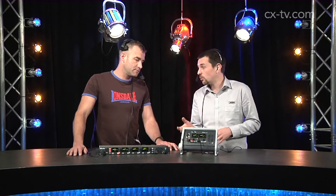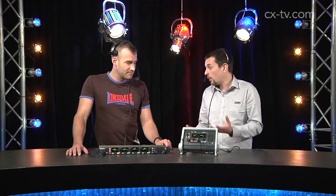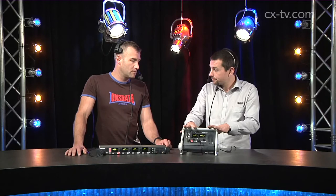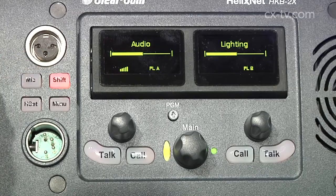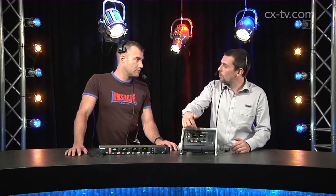This is a departure from traditional analog party line. With standard analog systems you'd usually have to cable both channels to a squawk box or KB box, but because we're using Ethernet technology, one cable gives us four channels or up to eight channels, plus a whole bunch of program material to these devices. You have a shift page — your first two channels for talking and listening, then press the shift button and there are your next two. It even displays what your shift pages have on them. You can name all your channels back on the master station.